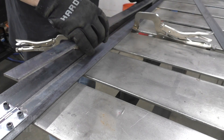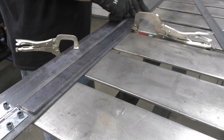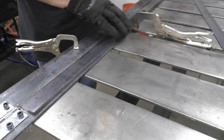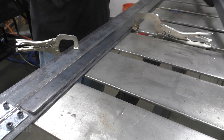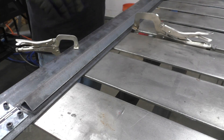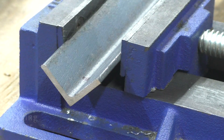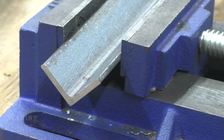I've got a piece of flat bar to go on here, but I noticed there's a little bit of a gap between it and the base plate — it's just because it's such a long distance. So to help keep this more rigid, I'm going to take a piece of angle iron and mount it on top like so. I need to drill a hole through the top point of this angle iron, so I'm going to drill it from the back side and work my way up with larger bits until I get the hole size that I need.